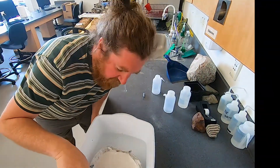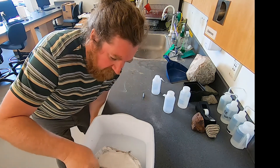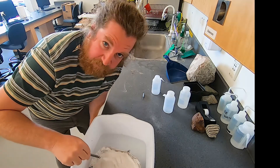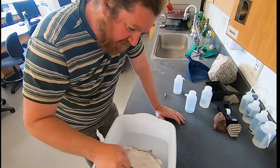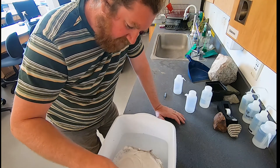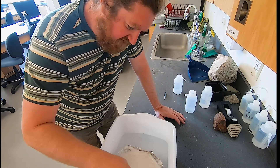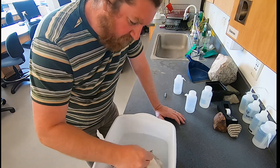I'm going to see how far along I can follow the path of actually making a cement. We might run into some problems with either clay or volcanic ash. What you guys saw was one of the primary steps in creating concrete. Fundamentally, lots of types of mortar, plaster, and cement are generally made out of just cooking limestone — and you could even do this in your wood stove if you could get to a thousand degrees Celsius.